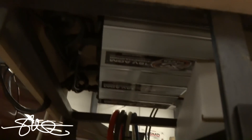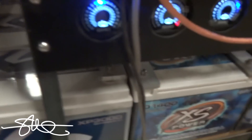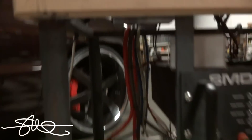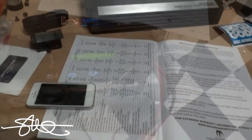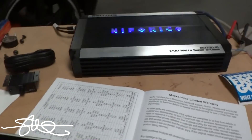Up inside of here, I have three chargers, one for each bank — 12, 14, and 16. I'm only using the 14 volt bank, and I'm only using that middle charger. It's not a power supply, it's a 10 amp charger. So it's not making that big of a difference, it's just keeping the batteries fresh.